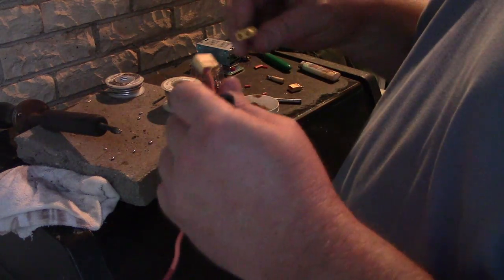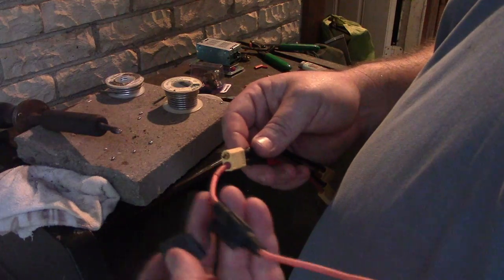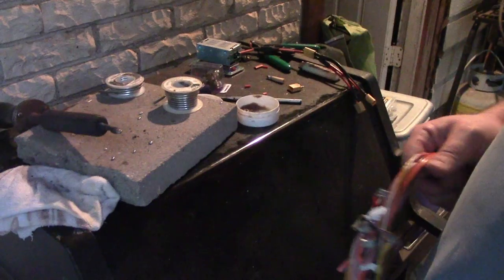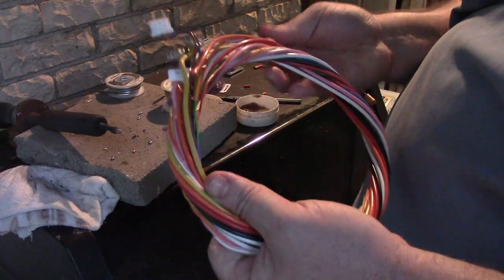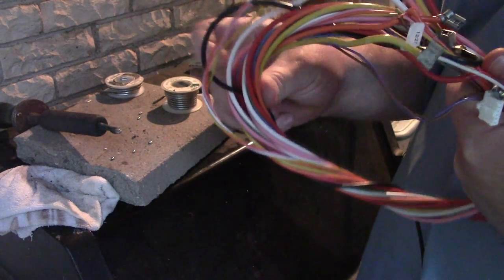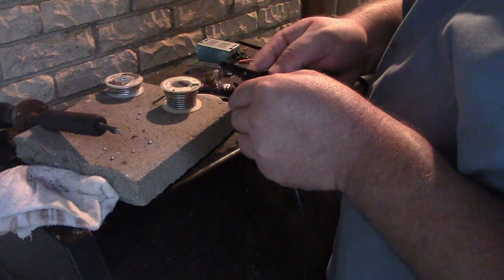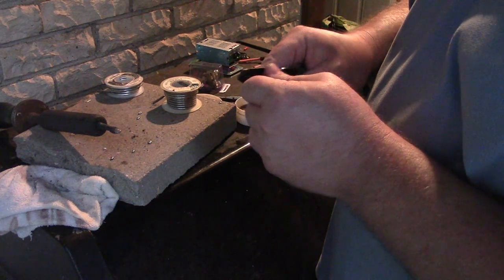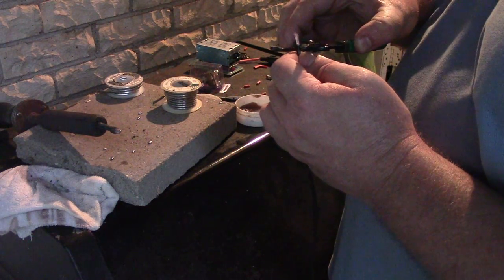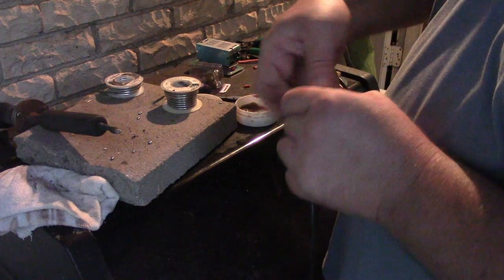You've soldered a connection. Let's go ahead and connect this before we melt some stuff. So now I need to find a negative cable. Okay. Here's some more cable that I've salvaged from something. I just want the black one. This is another nice copper cable. I think some of it I was using was aluminum. I think this might actually be a 10 gauge. Okay, it's a 10 gauge that I just stripped down as a 12 gauge.